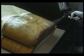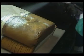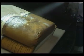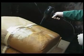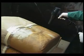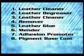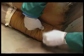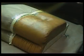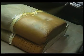This speciality is a soft polyurethane with extraordinary adhesion and high tenacity. To speed up drying, a hairdryer may be used. Now the leather is ready to be coloured. Match the sofa colour by mixing the necessary colour tones of pigment base coat. Remember to sponge apply the product in difficult areas. Spray two light coats. A hairdryer may be used for quick drying.